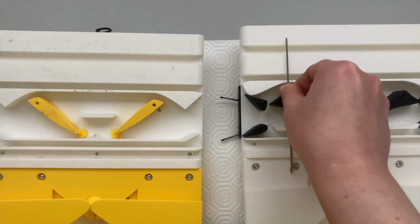A lot of machines use latch hook needles for this, but there are other needle designs that can accomplish the same thing. This stitch-forming action is typically controlled by passing the needles through a series of cams, an arrangement of levers and ramps that physically push the needles in and out along a predefined path that's coordinated with the yarn delivery. Incidentally, I think this is a pretty cool physical demonstration of the concept of pipelining, which is also a really important feature of modern computer processors that allows them to work so quickly.